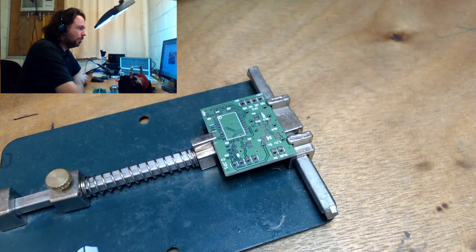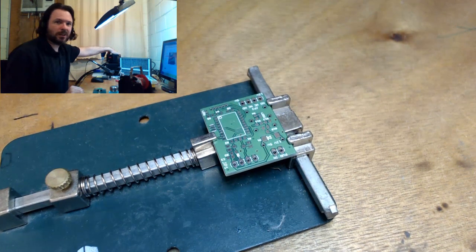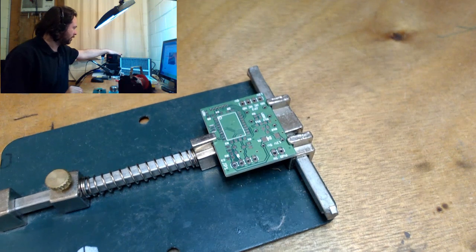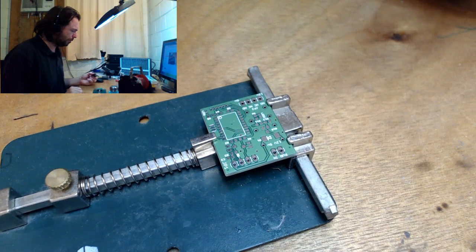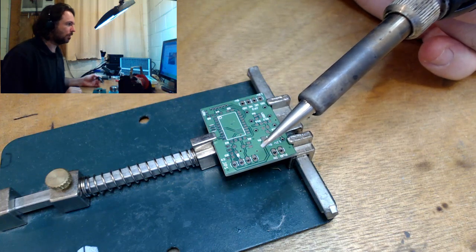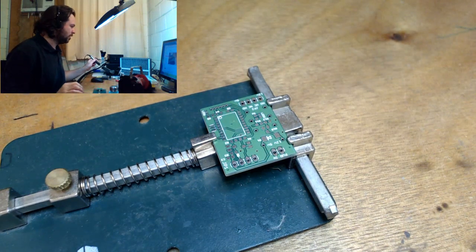CryJay, the iron I bought for my electronics training back in the 90s is still with me. Okay, that's a seriously old iron then. This one I got when I started doing fairly serious production work before I started doing reflow in the oven, and yeah, this one's lasted a good couple of thousand boards. The handle is very much like a Hakko, I think it's a 900 series or something like that. Anyway, I can't get as many tips as I want for it, but I find the best tip on this is a 1.2mm chisel type tip. Does the job well. I do have to crank the heat up a lot on it, though. It's one of the things that annoy me a little bit about it.